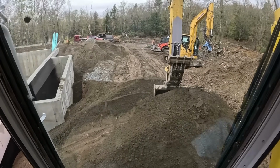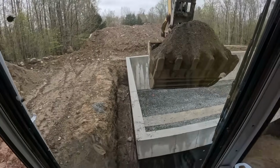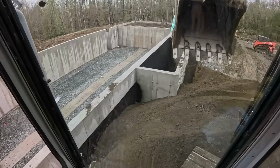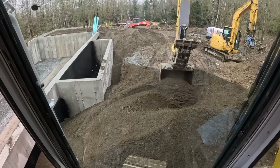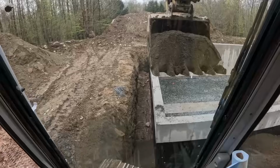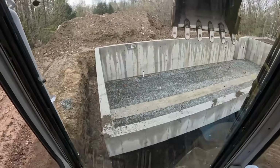There was only 14 loads for the allowance, but that garage, we didn't know the height of the garage. So once you got to shoot your elevations and you seen the garage was completely out of the ground, that takes like 7 trucks, I think, to fill that. I have to go back on my notes, but 7 trucks to fill that. So that's where the overage comes on backfill.